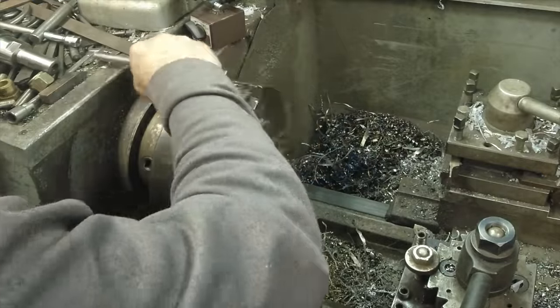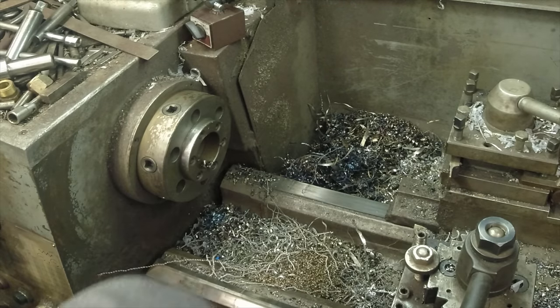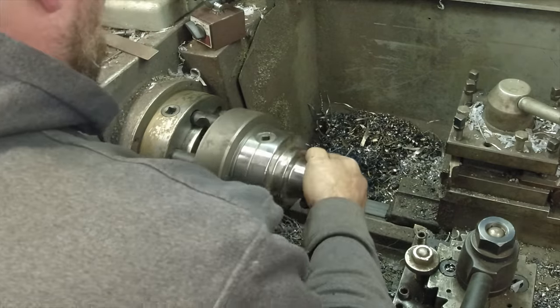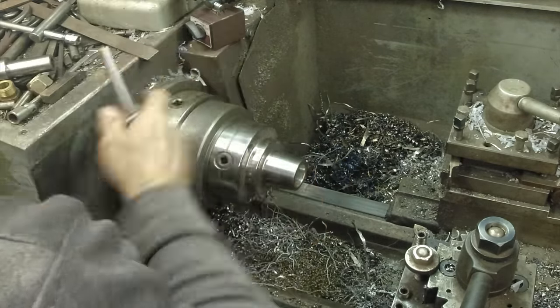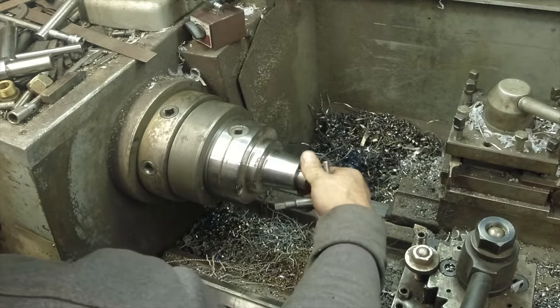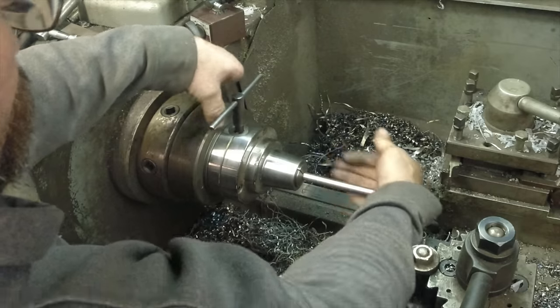In my 25 years or so of being a machinist I rely on using a four-jaw chuck for the majority of my work holding for the lathe. It wasn't until I started working on super tiny parts that I made the investment of purchasing a 5C collet chuck. Good ones are kind of expensive but definitely worth the coin. For even smaller work that I'll show you later on in the project, I mount a three-quarter inch straight shank ER16 collet holder in the 5C and it allows me to go all the way down to a 32nd inch diameter.